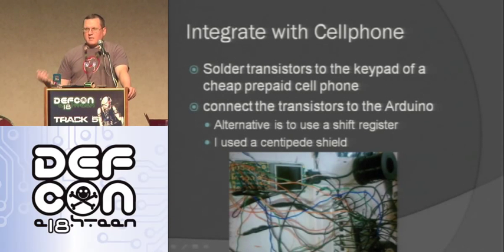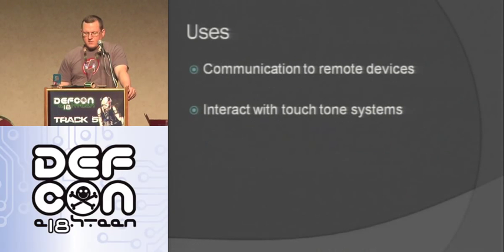I could connect these all directly to my Arduino but then I would use up all my pins and couldn't do anything else with it. So here's what's called a shift register, which lets you shift out what you want it to do. You can do the high and low signals using these shift registers and it only uses like four or five pins. But I ended up using the centipede shield, which uses I2C — just two pins — and since it's a bus protocol I can use a lot of different I2C devices, so it essentially doesn't use any pins.